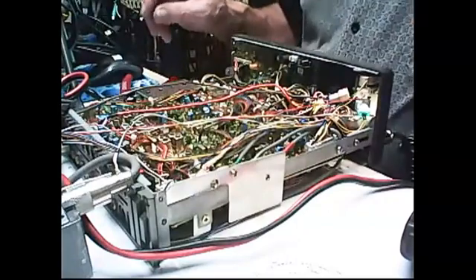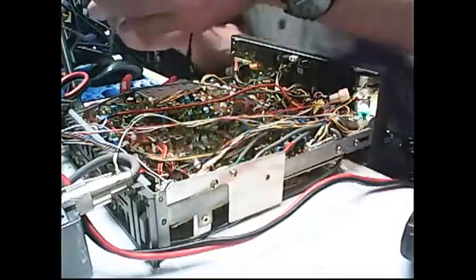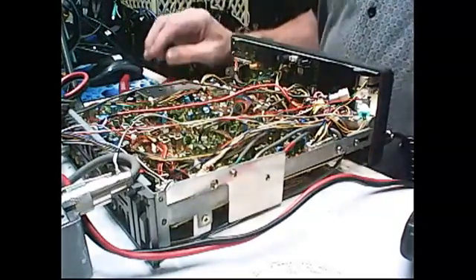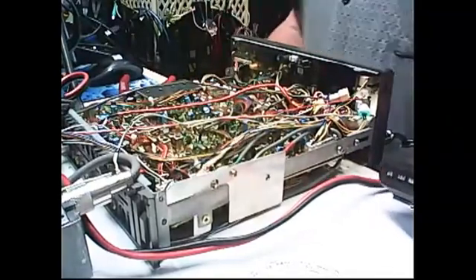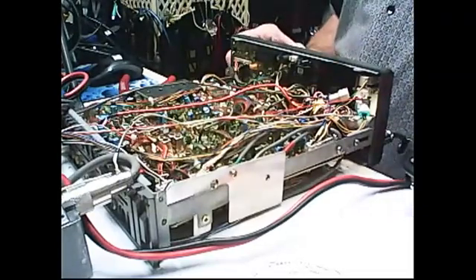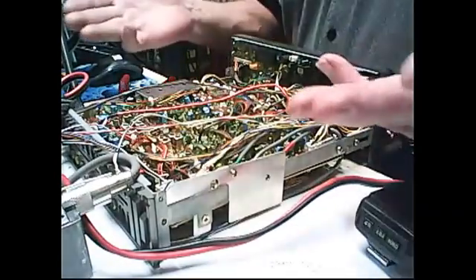Now all we've got to do is give it a little bit of power. Take the frequency counter here, put on the auxiliary pickup lead, and stuff it in next to there. Put this thing on AM, a little bit of power — it's about 10 watts — and make sure I'm on 14.000, which I am. And I have 13.999999. Okay, there we go. We're back on frequency.